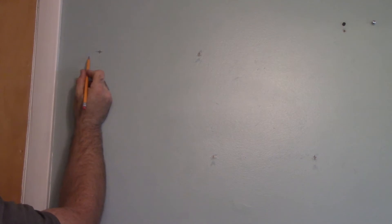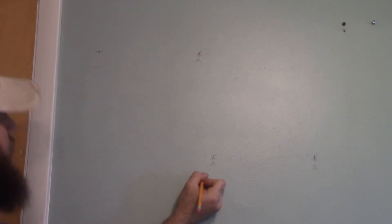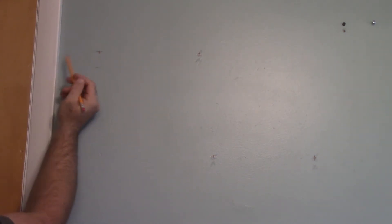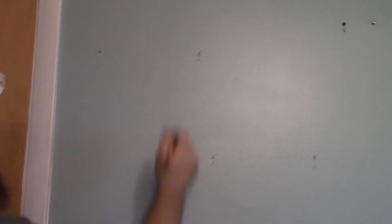All right guys, I've got my points put on the wall already just to save a little bit of time, but I'm going to explain how I did this. Right here is the bottom of our top shelf and here's the outside edge. I'm going to be measuring from the door frame here over, and measuring from the floor up to this point. Same thing — here's the bottom of our bottom shelf, here's the side. Off those measurements, I'm going to measure from the floor up to this point and then add an inch and 5/8ths to get our height right. We're going to be measuring from the wall to our outside edge and then adding an inch and 1/16th on these specifically. Your shelves may be set up differently with different spacings. From this point, I'm going to measure from the same door frame over exactly 10 inches, then measure from the ground up to that point and put our mark.